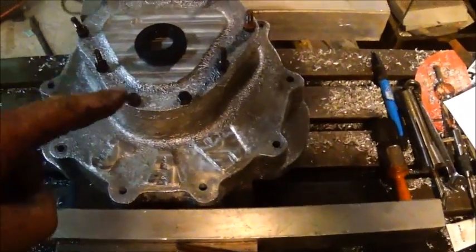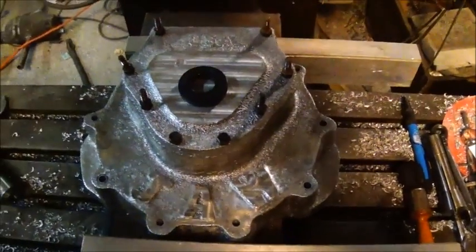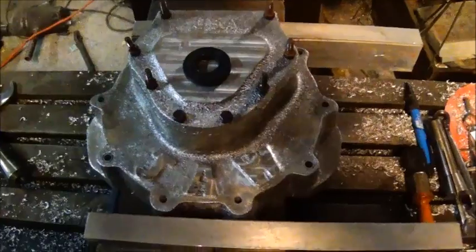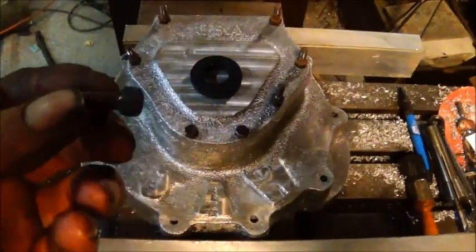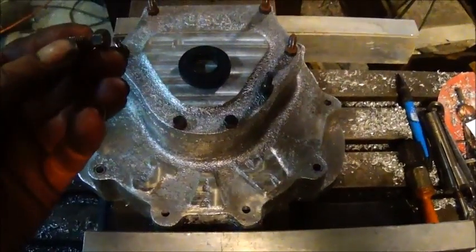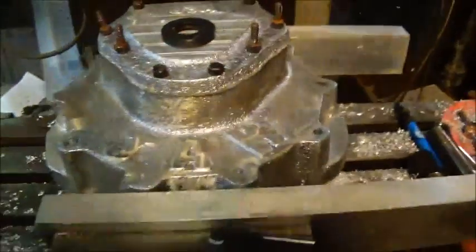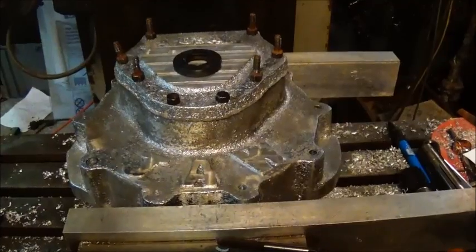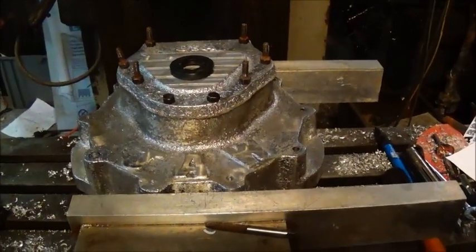That's all I could find. If I need to, I can make one for the center up here. It's nothing but a 1/4" 20 7/16, but the head's just down to 3/8, and I cleaned them up some, and I just like them. I guess because of the height of them, you can tell that they're old, besides the rust, of course. But I ran a die down all of them and cleaned them up, and they should be good to go. And I think it's going to work out good.